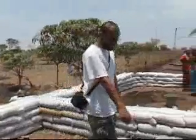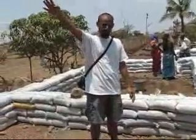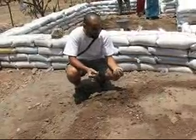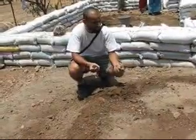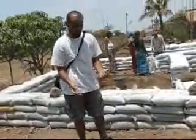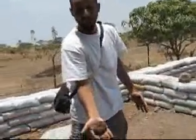Now we'll take a look at the earth. This earth has been brought from a construction site a couple of kilometers south from here. The kind of mud being used is of a particular type which has a low clay content — around 20% clay — and it's on the sandier side. We have kept this depot slightly moist, watered it down so it absorbs the water, so that we can get a consistency that's not too wet and not too dry.